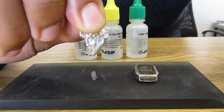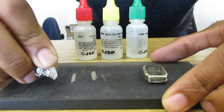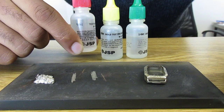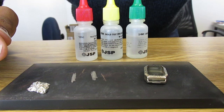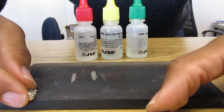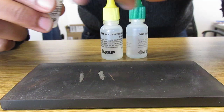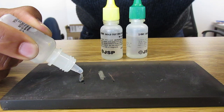First, I'm going to test silver. I have two scratches here — I'm going to make a second scratch actually. With silver, you will want to use an 18 karat gold acid test. The main reason being, when you test this acid, it won't disappear because it's not 18 karat gold like it would if something that was actual gold wasn't 18 karat. What's going to happen is it will turn an almost neon blue. So I'll show you that here. This is my silver scratch, and this is my 18 karat gold acid.